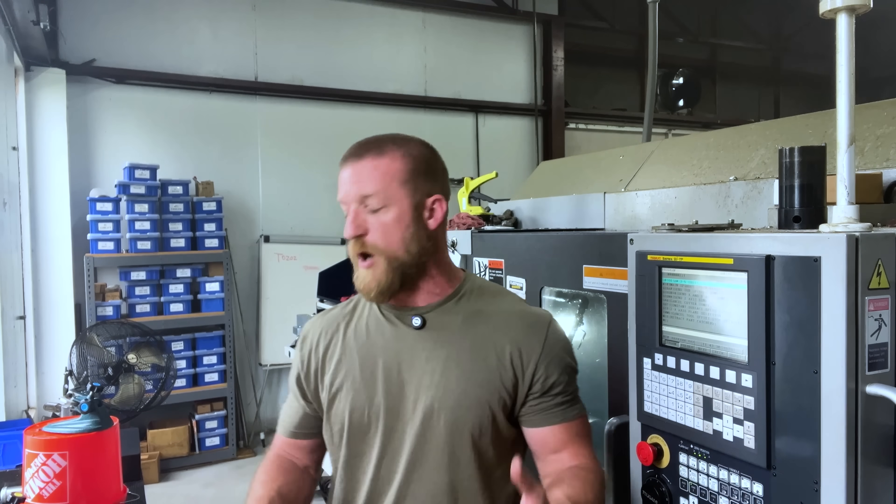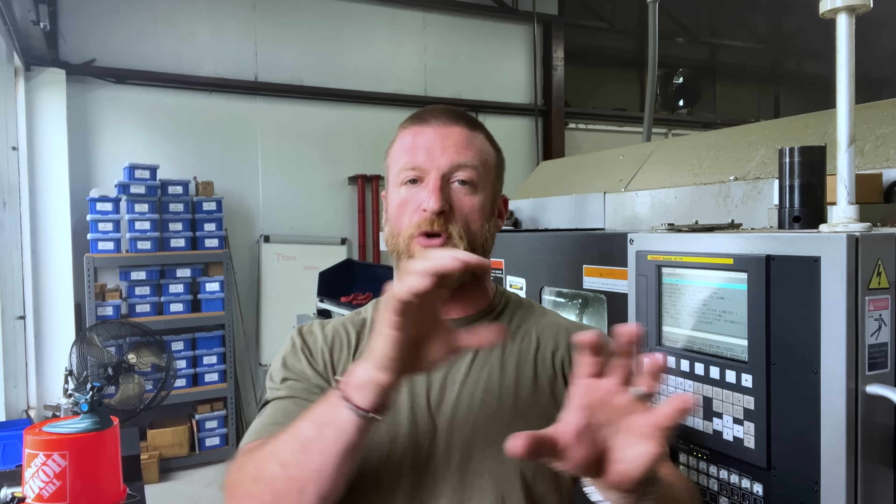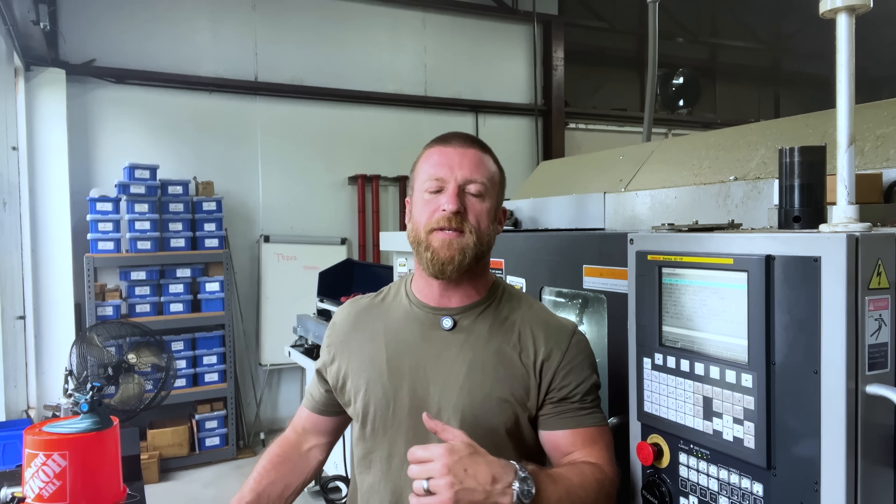If you're drilling, you want to try to have through-tool coolant. If you don't have through-tool coolant or through-turret coolant, some of our machines don't have it at all — we have to use what's called flood. On your drill, you're going to have another line that hits the drill. Add a pecking cycle if you're doing deep hole drilling to get coolant inside there, help flush out the chips, and help keep it cool. Now we're going to take a look at some coolant delivery methods employed in my machine.